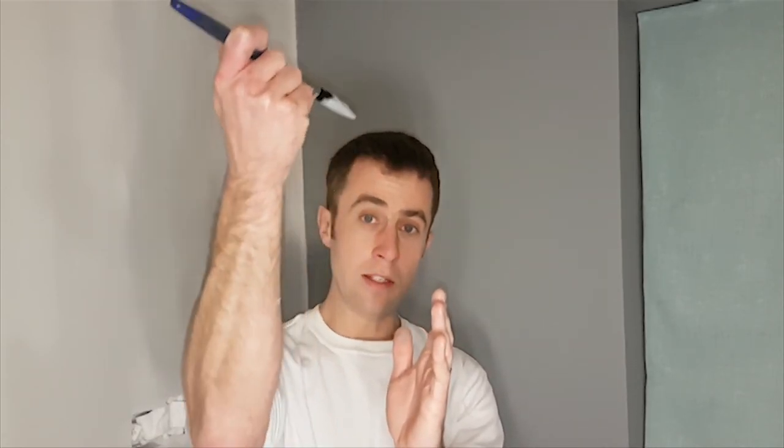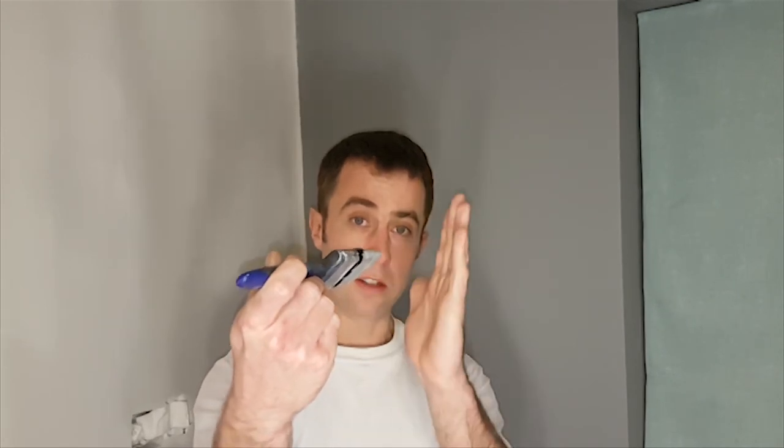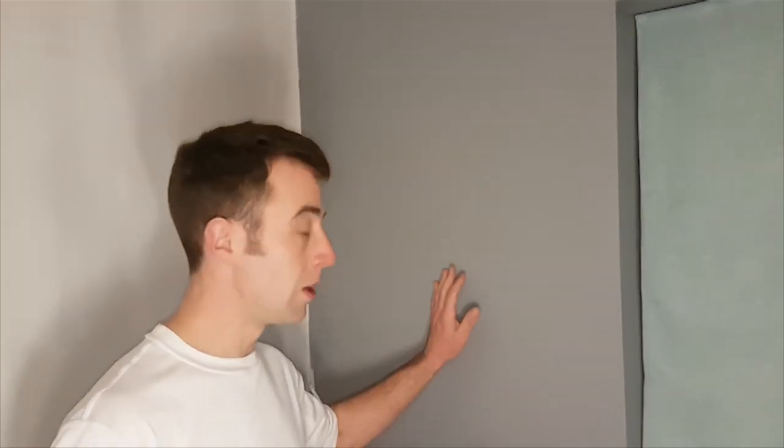With regards to the technique: if you're going up, hold the brush at a diagonal. If you're coming down, hold it at the opposite diagonal. The reason is that if you hold it at that diagonal going up, the paint on this side of the brush will gradually work its way down, so the brush lasts longer and the paint spreads evenly into the corner. Similarly, coming down, hold the brush at that diagonal and the paint will work its way to the other side of the brush. Once that paint's dried, if you're not completely happy or you've lost a bit of the roller texture, you can get in there with a roller and get as close as a quarter of an inch if you're careful.